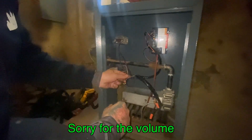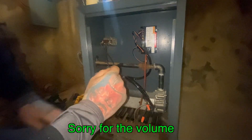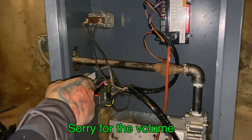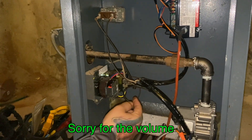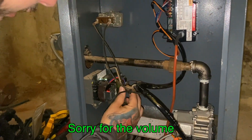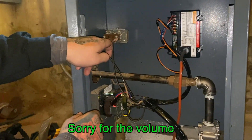Okay, so this is the thermostat wire — it's on R and it's on G. G is a coil. So when R is energized, they close the coil. Closes the coil — this is the G wire. The G wire now sends 24 volts to the limit switch.